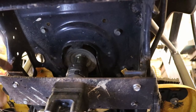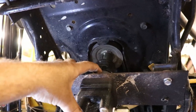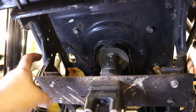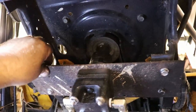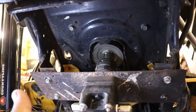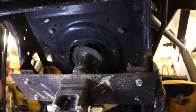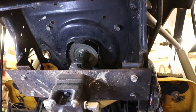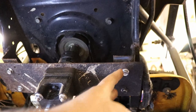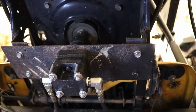Slide it on there and wherever this falls — I've got washers in here because I had to change the coupler when I changed the pump out and this coupler was taller, so I had to bring the plate down. You won't have washers on this when you do it. Once you get it pushed up in there — not really really hard, just push it up and make it stay — then take some vice grips, clamp these angles in here, make sure everything's straight, and then weld it in. Take the clamps off, start the motor, loosen the four bolts, and if there's any vibration it's going to self-center. Then snug the bolts back down and tighten them.